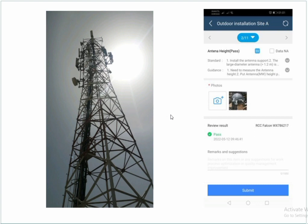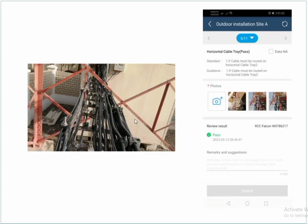Take a whole picture of the tower to show the microwave installation. Next, check the horizontal cable tray — quality cable must be laid properly and attached with cable clamps. Take pictures of the horizontal ladder completely.